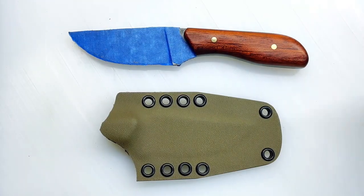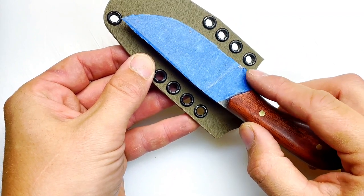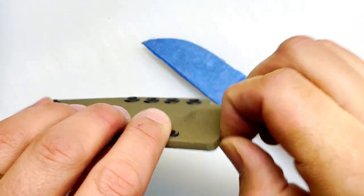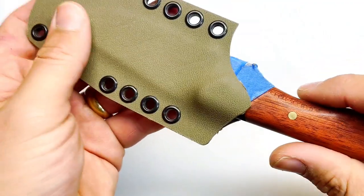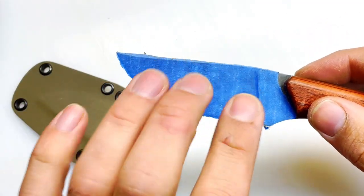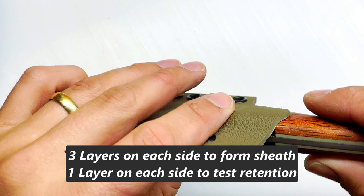Let me show you the retention up close. The impression of the knife — you can see where the finger groove will sit; that's what's going to hold it in the sheath. I went from 120 to 220 grit and we check it so we don't remove too much material. It's pretty tight on the retention but not too bad. I put on three layers of tape to give a gap so it's not too tight, then took off two layers and left one just to protect the finish of the blade.